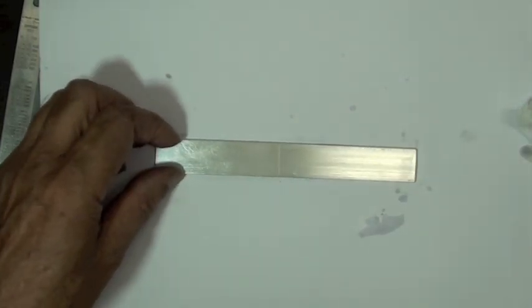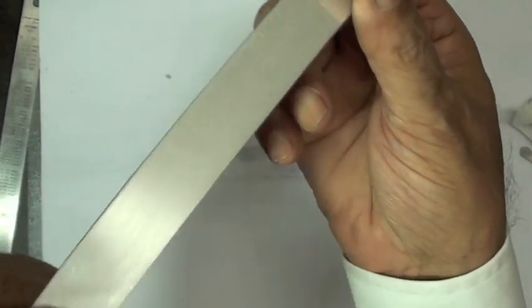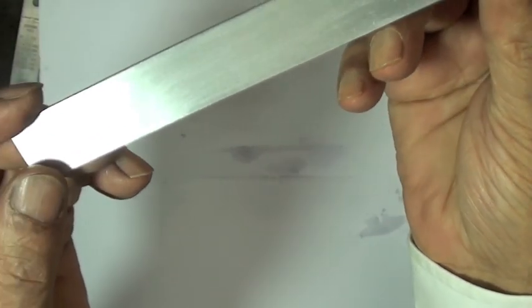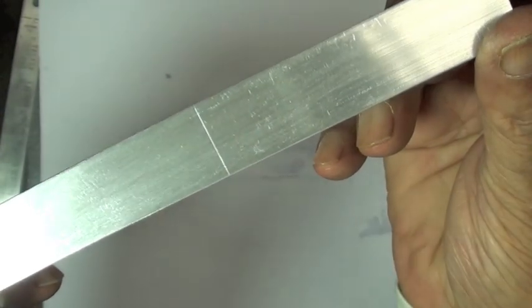And can you show the burnish there for the camera? Does it show up in the light? Okay. So you can still see a mark on there. The pencil lead is entirely gone, but we can still see a burnish mark that will allow us to accurately position the strain gauge.